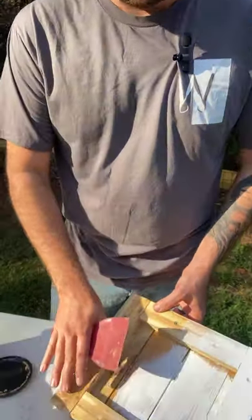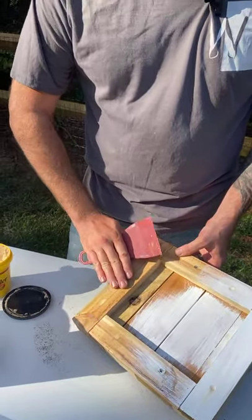It may take one or two coats, and that's okay. Apply one, let it dry, sand it down a little bit, and then put your second coat on until you can run your hand across it and feel that it's smooth — where you don't even hardly know it's there. That's kind of what you're looking for.